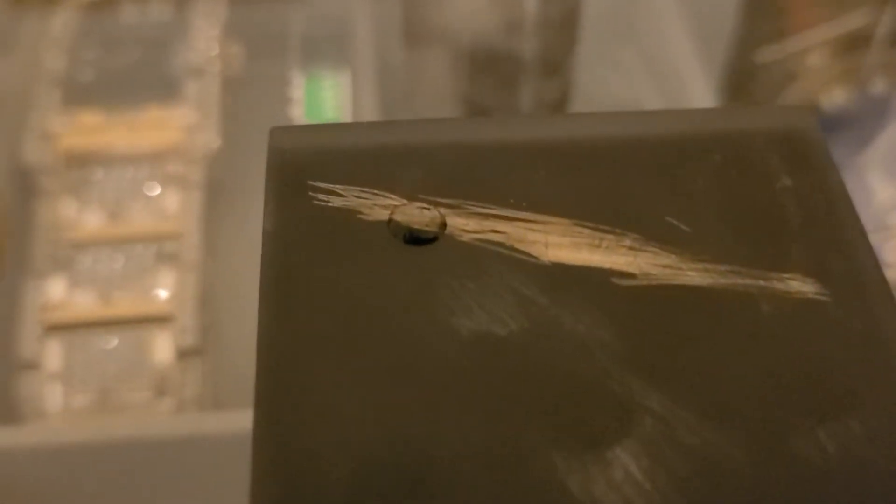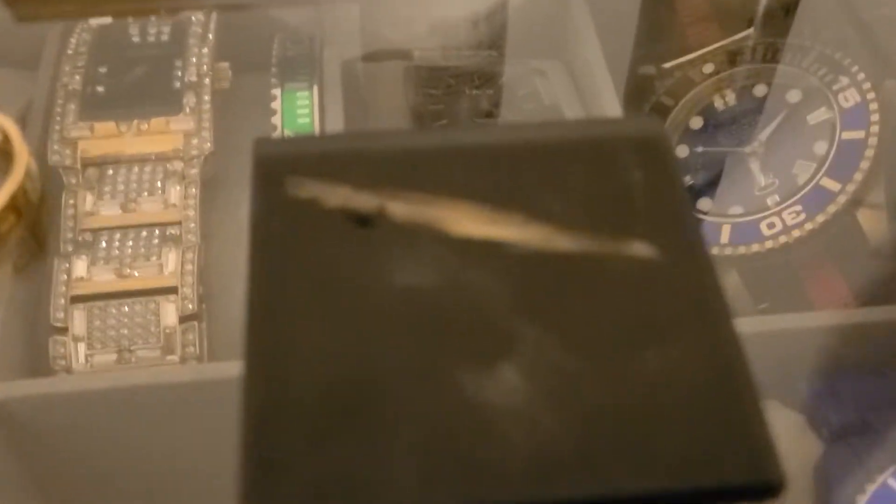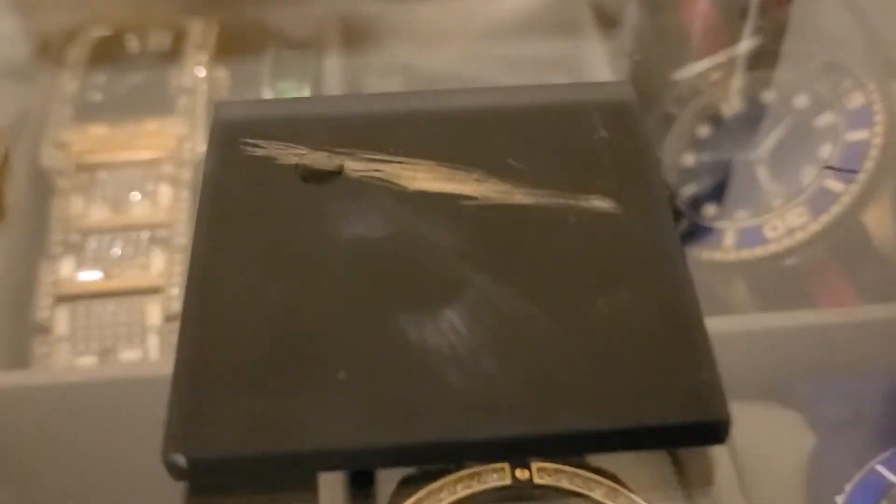I went ahead and scratched a sample onto the stone, and I'm going to start dropping the 10 carat solution to see: A, if it's real gold, and B, if it is real gold, if it's anything lower than 10 carat. We're going to drop a tad on there. If it's not gold, it would disappear right away. So it's a good sign — it's been a couple minutes and the gold is there. It has not disappeared and it's not smoking.